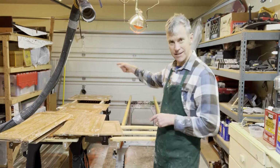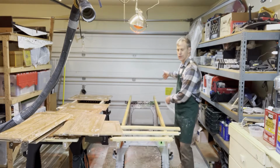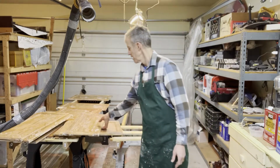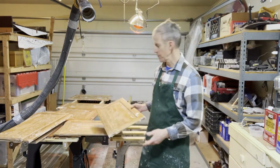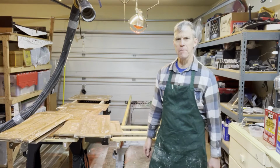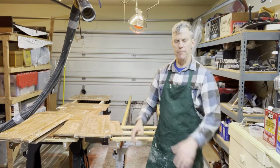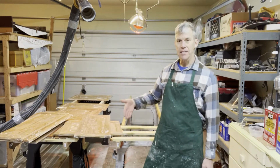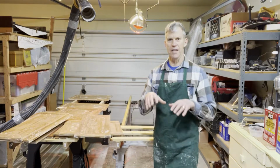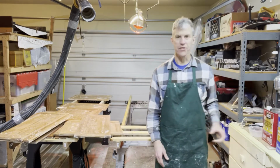I also had the same idea originally of using the stripper. I thought I would apply, and then strip. But it turned out I could only really strip 2 or 3. When they're this size, 2 is really all you can do at once, because I would apply it to 2 of them, and by the time I was done applying, I had to wait maybe 3 or 4 minutes for the first one to start. You saw it, it sort of expands but shrinks, gets this rumply look. Now the problem is the second one, so I start scraping on that, and then the second one starts to dry, and then it re-adheres. So you really have to hit the paint while the paint stripper is gooey.